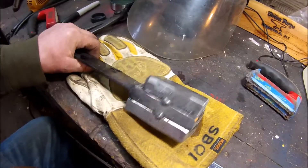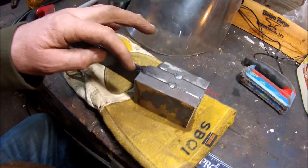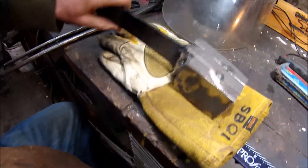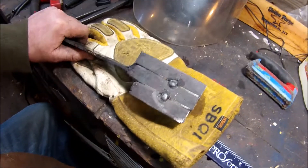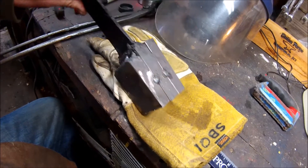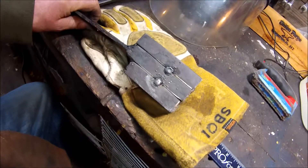What you see here now is the billet ready to go again. Each of these pieces is 19 layers, so roughly 60 layers of steel in the final billet. I didn't do a great job measuring, but it doesn't matter — this isn't a science of preciseness, it's pretty brute. All I've done is taken the MIG welder and tacked it just enough to hold together.